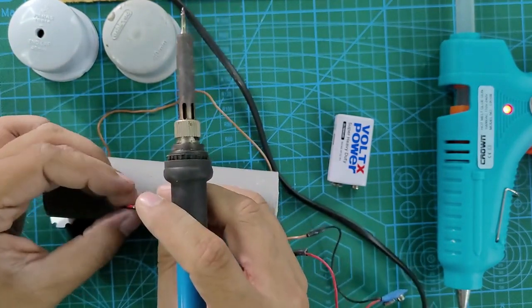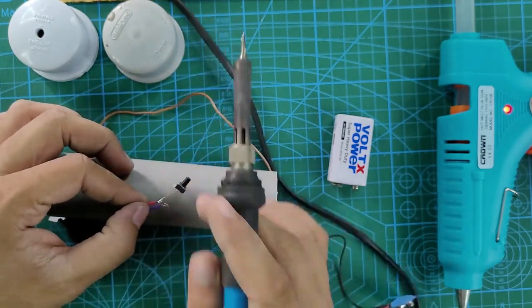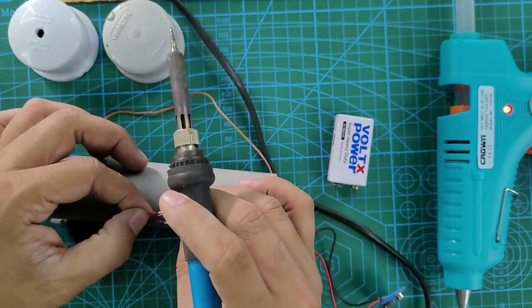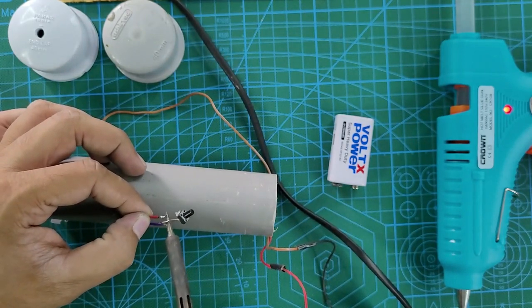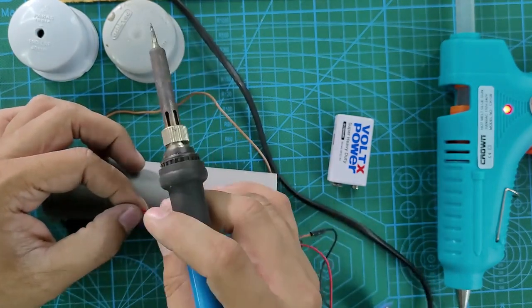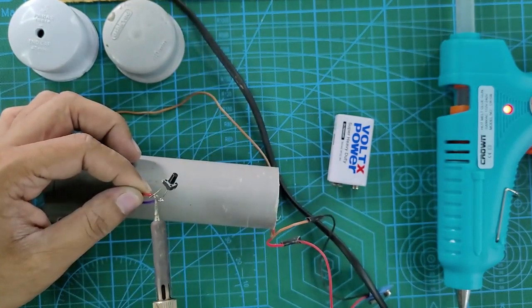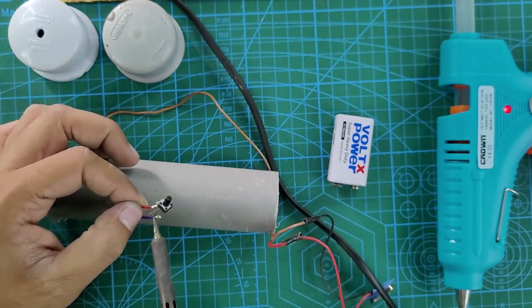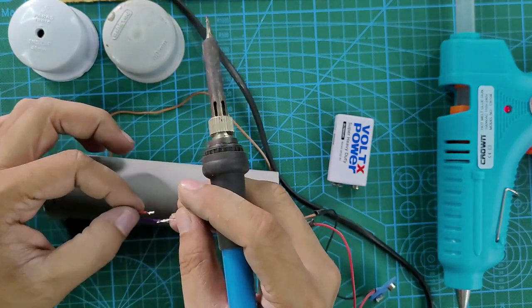If you have already put some soldering metal onto the terminals before you hold them together and join, it easily gets melted and it easily gets connected. Just take some help if you are struggling to hold it properly. Take some help of your friend or your teacher. Since these are critical, small dimension joints, you can take some help of others. That's perfectly fine.